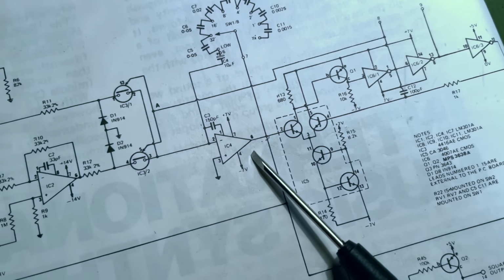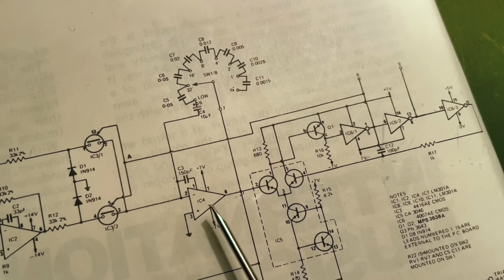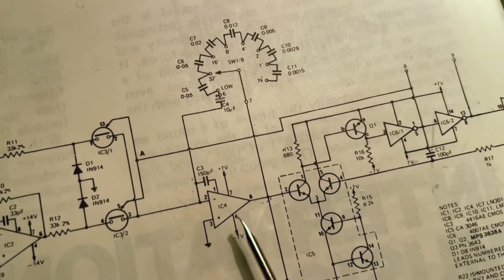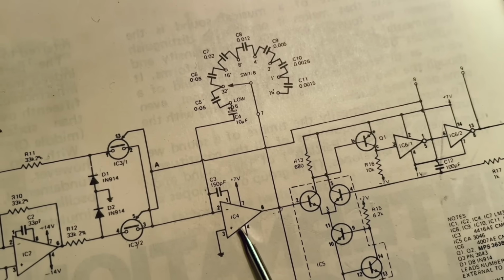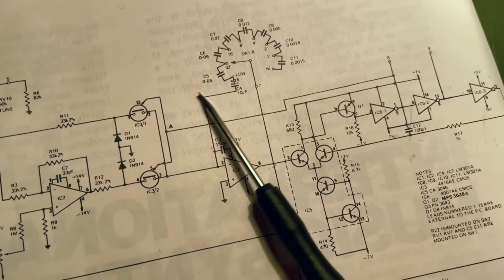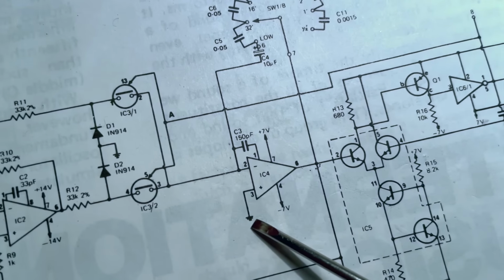It is important to note, however, that this op-amp integrator is actually going to output a negative integral, and that's because it's kind of like an inverting amplifier. You've got a negative feedback loop here, and what op-amps try to do is they just want both of their inputs to equal the same thing. They want them to be the same voltage. So the output of the op amp will feed back through this loop here to try and counteract whatever is coming in here, in this case to make it equal ground.